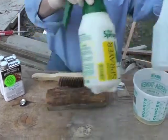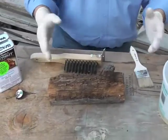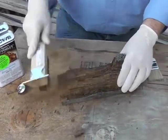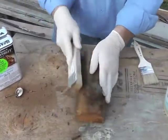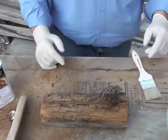When you go to apply the sealer into a rotted area, all you need to do is take off the loose dry rot that you can with your hands or a wire brush. You don't need to gouge it all out — just get the loose material off. You don't need to spend a lot of time with this; just get the loose off and start applying.